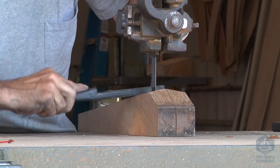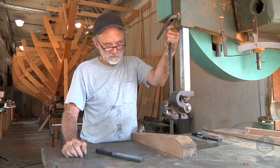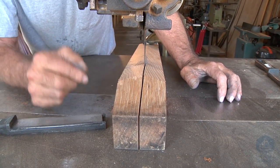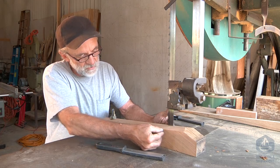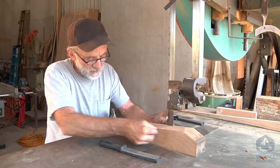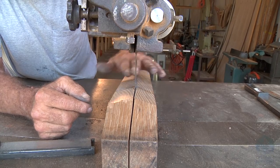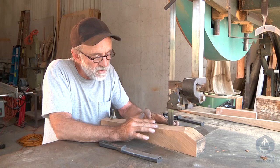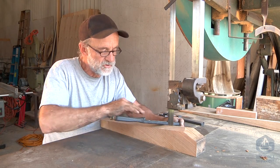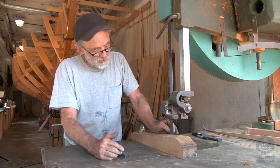So I'm going to give you a quick demonstration on how I go about sharpening these large blades. We try to keep the blades in there as long as possible, and this is the method we're using. I've got a piece of oak cut on a five-degree angle down in this direction compared to the table — this being zero degrees — and then I put an angle on the top of it in both directions of about eight degrees. That eight degrees represents the angle I want the gullet across, and the five degrees represents the angle I want the gullet to be in this direction.